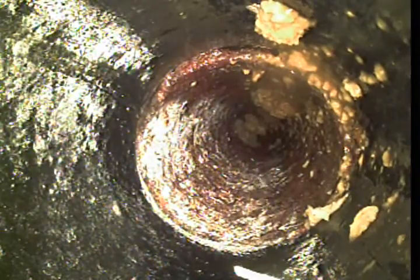There we go. You can see the lip. We're upside down, so this is the bottom of the pipe. This should be matching up with that. It's a little bit of an offset, so that tells me that one of the pipes has moved, and because the ABS is lower, I'm assuming this pipe stayed and this one lowered, because further down, just a little bit down here, is where it's collecting, and I had to push it to break it up, so it's got a grade issue.